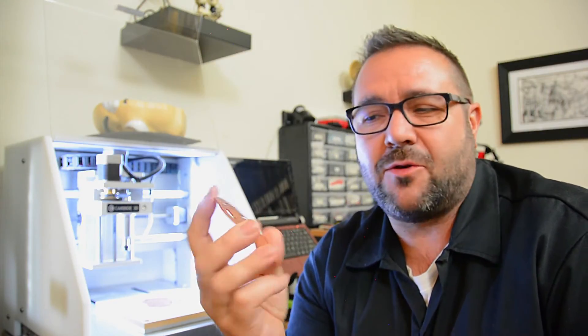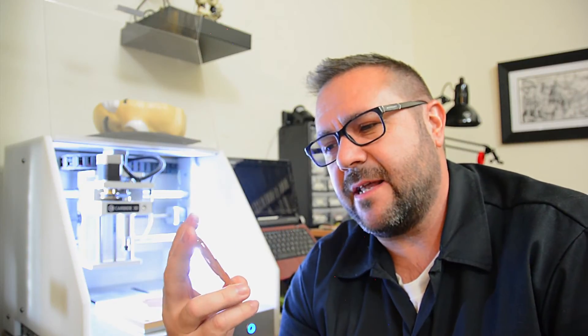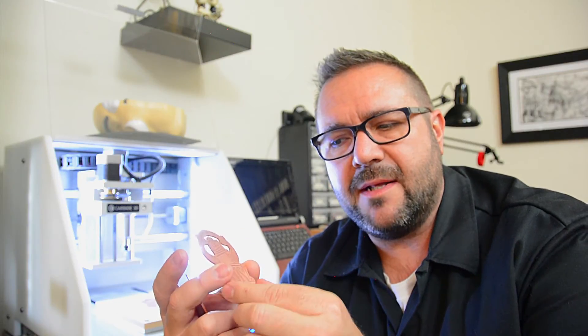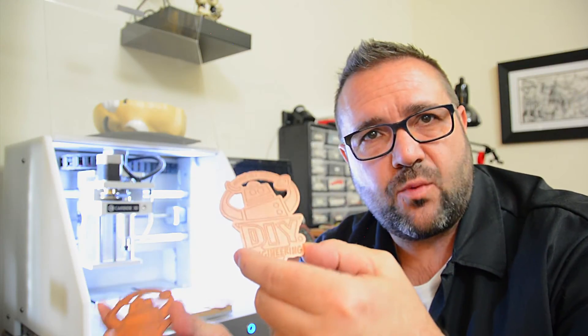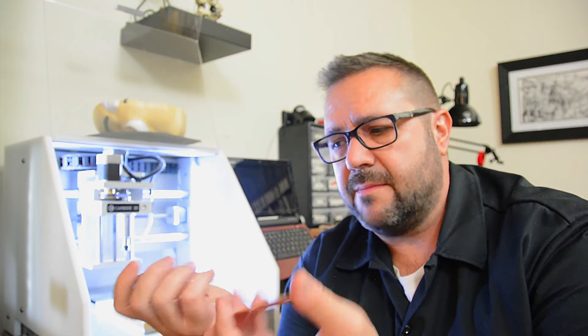These things look amazing coming right off the machine — finished quality, really beautiful. I'll probably put a little clear coat on to protect the copper from oxidation. I did about five, got it down to about four minutes per piece. I'll just run them over the course of the week and by Maker Faire I'll have a stack. Here's one with just outlines — about three minutes — and one with a pocket cut, which takes a little longer. They're great; it cuts through the circuit board like butter.